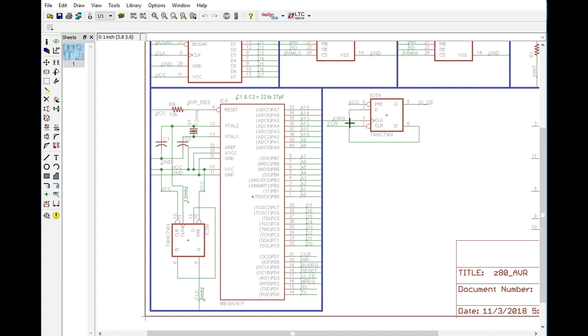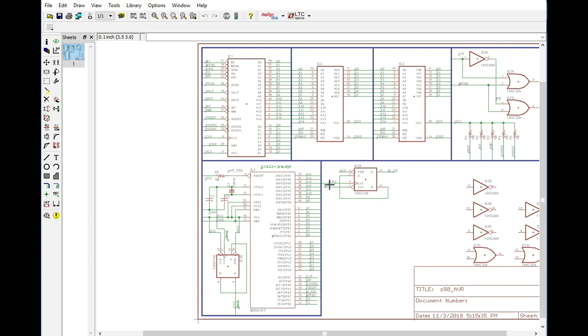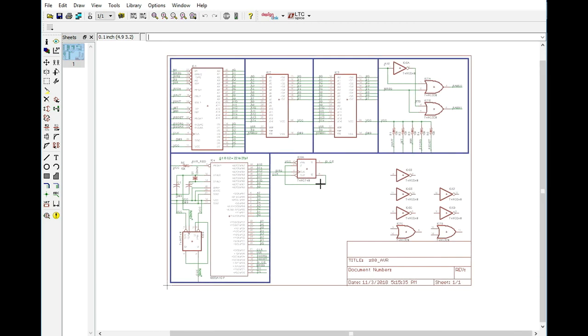The only difference is we are going to be using the not Q output as the wait line, and the reason for that is because we have to basically interrupt any further T states by the processor. And this is a pretty simple way of doing it, I think, because it is technically a memory fetch. So we're essentially just telling it, hold on, we have to read this information from the bus before we're going to be ready to go. So it's an interesting way of handling it.